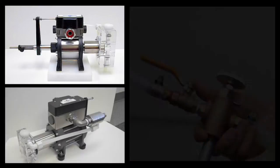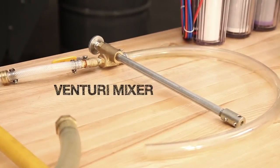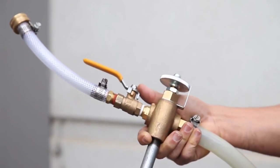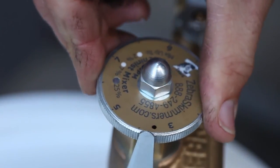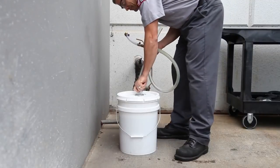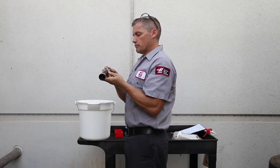Proportional pumps are usually used when higher volumes of coolant need to be made frequently and when coolant needs to be pumped over longer distances. When lower coolant volumes need to be made, the venturi mixer is the less expensive option. The mixer uses water pressure to draw a metered amount of concentrate up into the water stream where it mixes completely with the water as it's dispensed. The mixer can be adjusted to output a range of concentrations, and once you've found the setting you want, note the position of the dial or mark it in case someone else adjusts it. Place the mixer's suction tube into the concentrate container, then connect the mixer's water inlet hose to the faucet. Dispense a small amount of coolant and check it with your refractometer. Once you have the mixer adjusted to your satisfaction, you're ready to mix coolant.